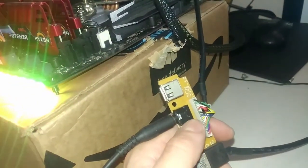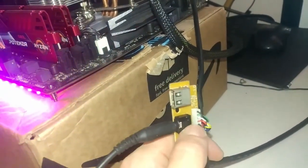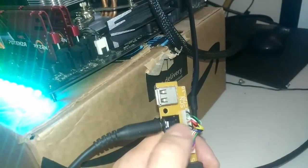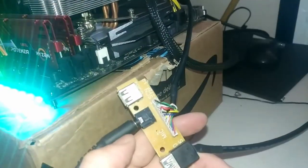I'm gonna take the mic jack off, put it back where it goes, and try to put the headphone jack back on. I think I might have actually fixed the physical problem — I took the back clip off and bent a couple things just so that it makes better contact with the plug. Time to swap them out.